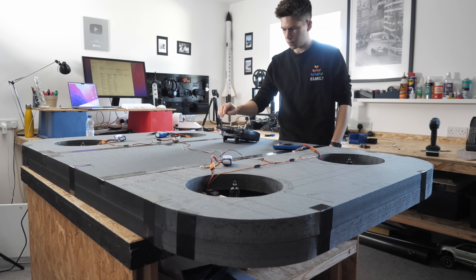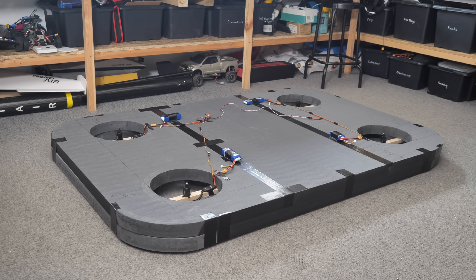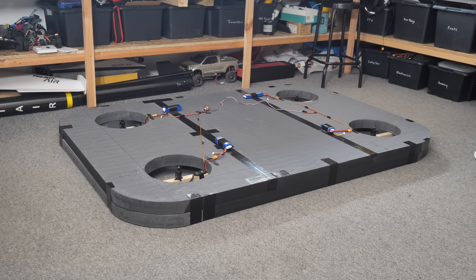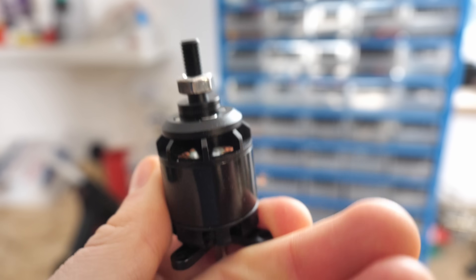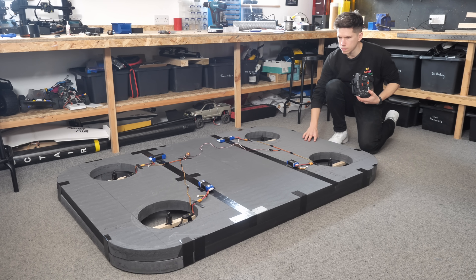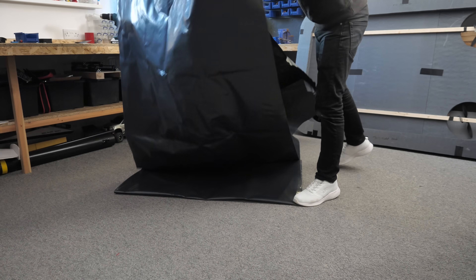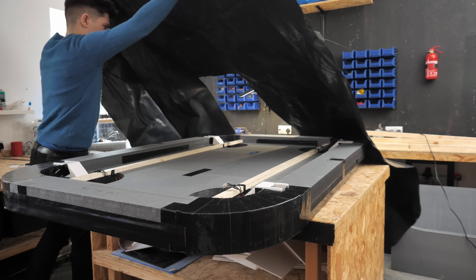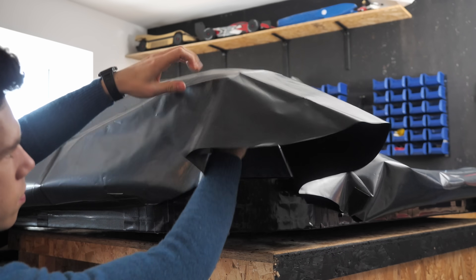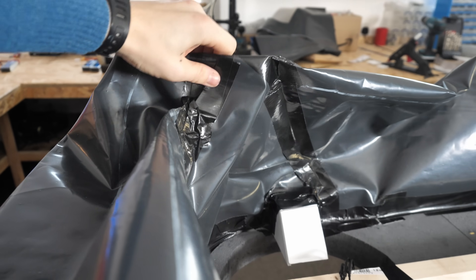I needed to find out how much power I'd need to lift my 70 kilograms and the total mass of the hovercraft itself plus all of the heavy batteries. I thought I'd just use some motors I had lying around in my workshop and see how much they could lift. Even without a skirt the bubble of air trapped beneath the hovercraft seemed to lift quite a lot, so the next thing was to cut out a donut-shaped skirt from a damp proof liner that I got from a DIY shop and stick it to the hull using lots and lots of duct tape.